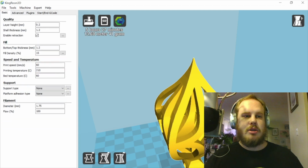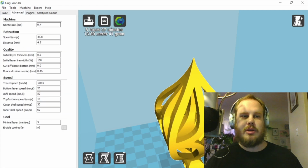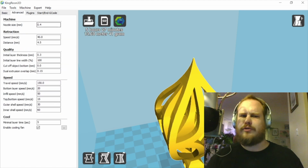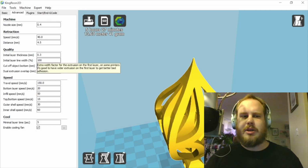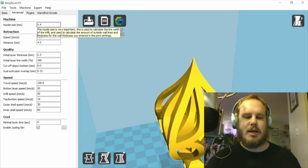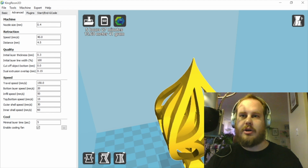You want your layer height to always be evenly divisible out of your nozzle size. So 0.2 or 0.1 or anything that can go into 0.4 an even amount of times. I know I'm not using the greatest terminology to explain that, but I believe Prusa Printers has a calculator on their site that will give you different layer heights that will work for your nozzle.